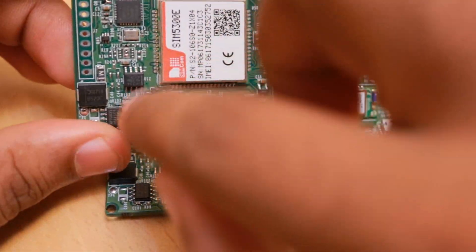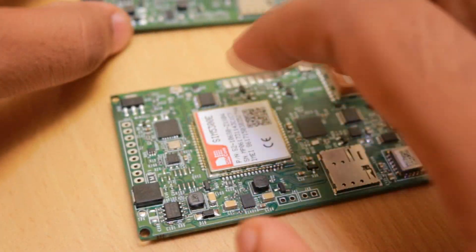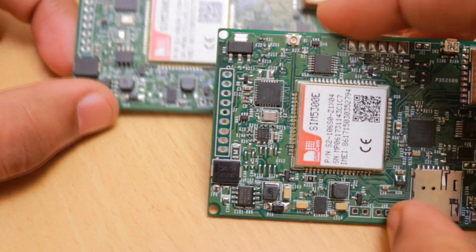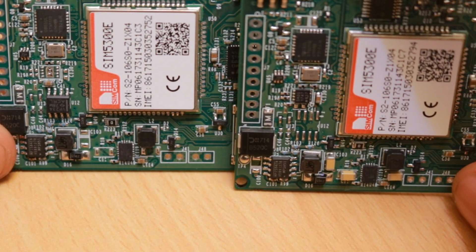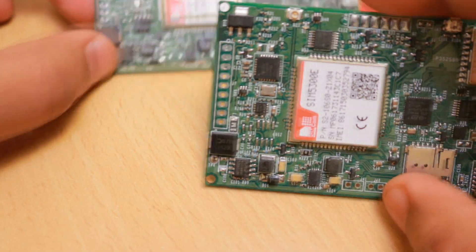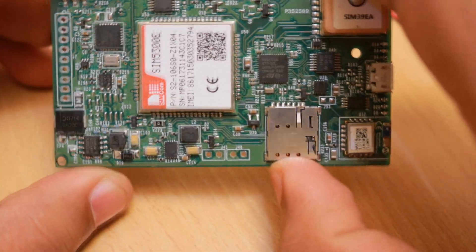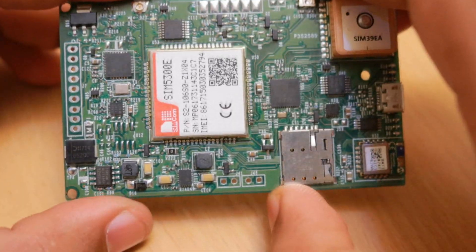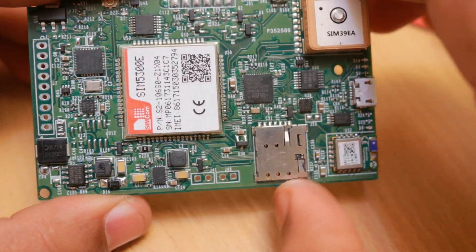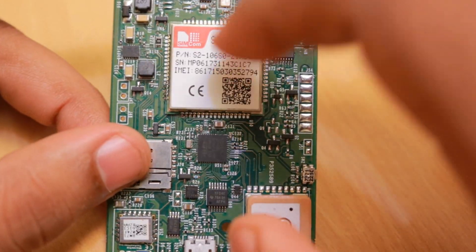This chip is also doing a similar thing for a different protocol — I think this is used as an ISO transceiver and it supports decoding of the J1850 bus. I basically used two CAN transceivers here: one that's used in the SparkFun board, and another different one from Texas Instruments, which is more expensive. So I made two options and I'll test both of them — based on their performance I'll select which one is better. This diode provides reverse voltage protection, preventing damage if the power supply is connected in reverse.